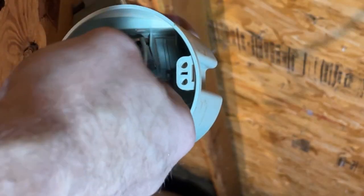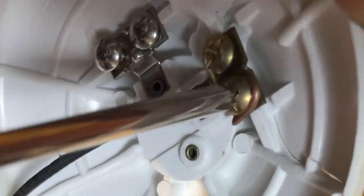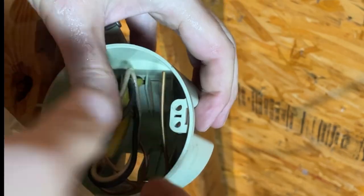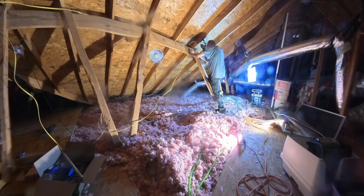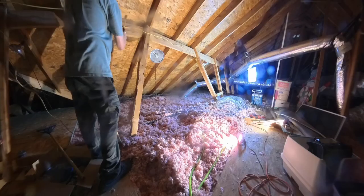After the wire is untangled, I reconnect it. The wire is pulled through the box and attached to the fixture. Light fixture wiring is really easy. The darker screw gets the darker wire. The wires are pushed into the box, the fixture is screwed on, and the bulb is screwed in. The wire staples are hammered into place to support the wire up and out of the way. That's what it sounds like to hammer with a bionic arm.